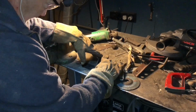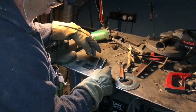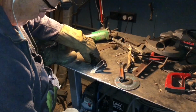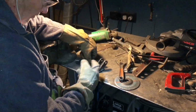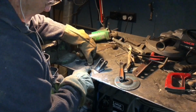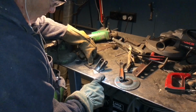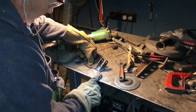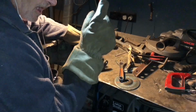before we weld this back together, I think we can dry run it on the tractor without doing anything and just see if we're on the right road. How easy would it be to produce 2 types of brackets? One with power steering, one without. Or, if this bracket works, why wouldn't you just produce all the brackets to work with the power steering version, rather than with a non-power steering version? And then you've got to supply the right size belt, which is going to be bigger. Let's take this out and try it.